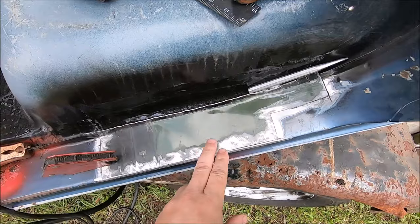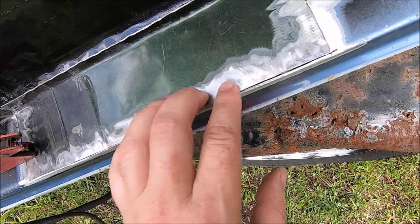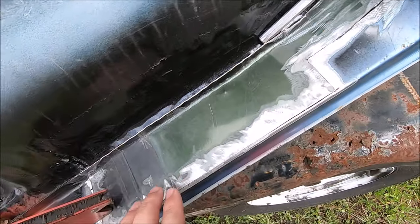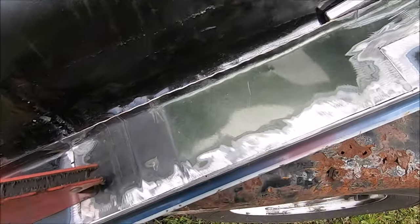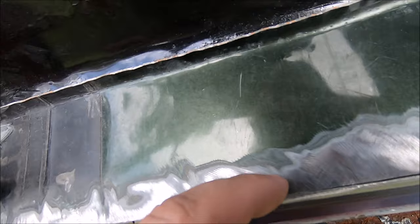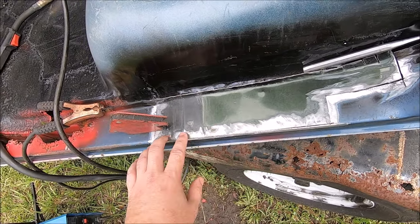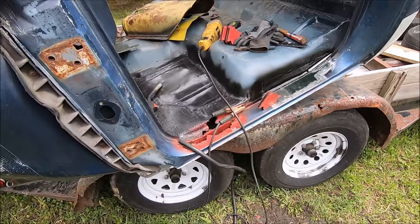I think I got this piece pretty good. I'm gonna tap it into position, pull it up and fold it as necessary to get it close, and as I get to this end I'll tap it down and make sure these relief cuts align. I think this should be pretty good — not a lot of gap there. There's a little bit that's gonna need pulled up. I think we got a pretty good start here; I'll just work from this end and snick it that way.